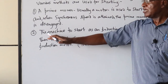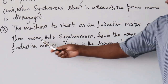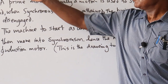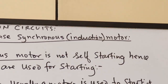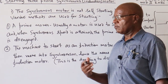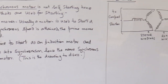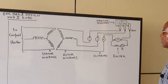The other method is for the motor to start as an induction motor and then move into synchronism — hence the name synchronous induction motor. The topic here should have been simply 'synchronous motor,' but I included the induction bit to indicate the starting method: the motor starts as an induction motor and moves into synchronism, which is the method commonly used in industry.